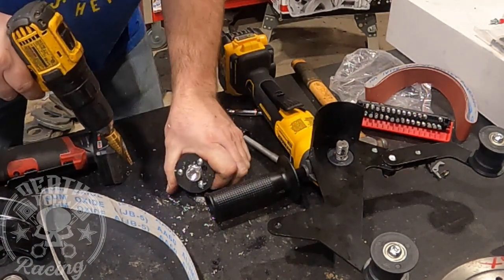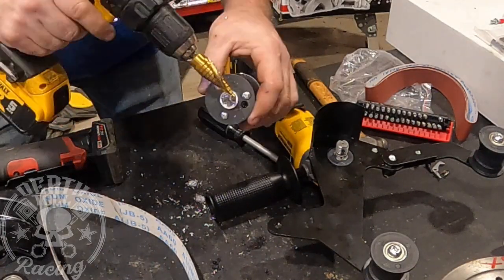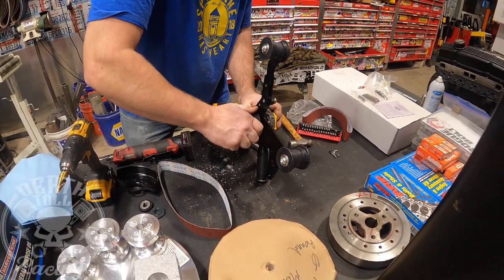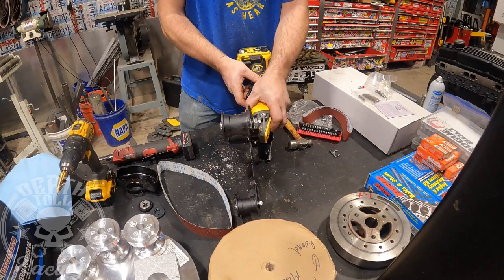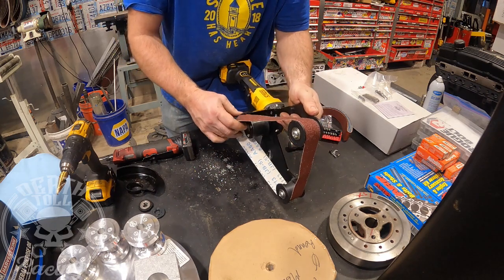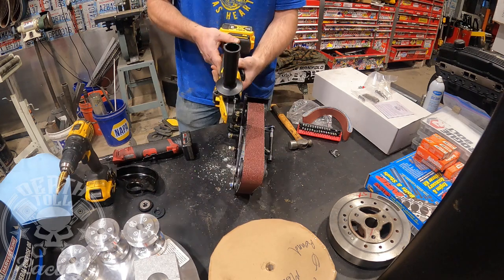We just need to get the chamfer back since I just ground it all off. Once we're all done and we get the offsets right, we're going to file that and try to file it as flat as possible. That looks pretty good — I think we got it. That looks a lot better already. I ended up taking about a quarter inch off of that thing. I want it engaged on as much of the grinder as possible, just so everything kind of stays rigid. It's still a little to the inside, but the belt is a lot straighter now.